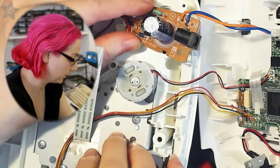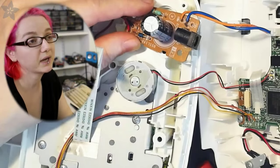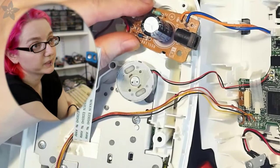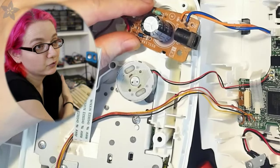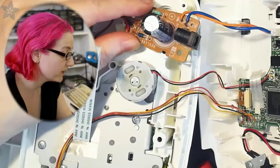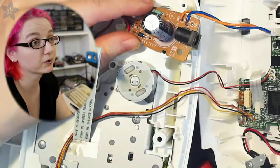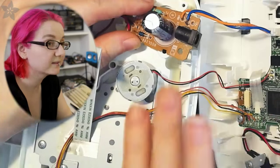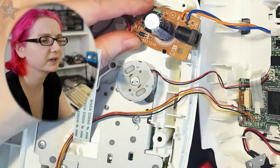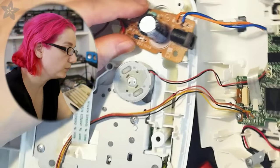Whatever makes the ink transfer takes some power, and the motor takes some power. They want to get rid of as much of the big ripples as possible, because it's so cheap to add a gigantic capacitor. So that's why it's so big, and they had a lot of space. I wish they'd gone with a nicer PCB, but it's not surprising that there's a gigantic capacitor considering there's a motor inside, and they want to make sure the LCD bias voltages are nice and clean while the motor's printing. They don't want that weird flicker effect you sometimes get when the voltage raises and lowers. They did use paper phenolic also